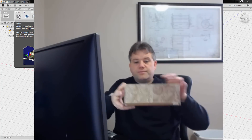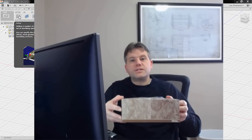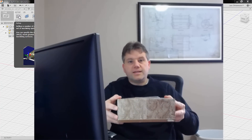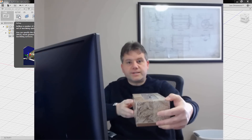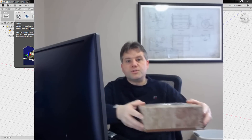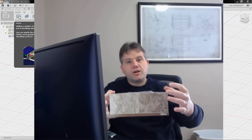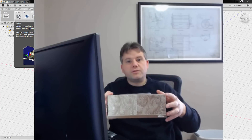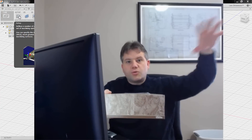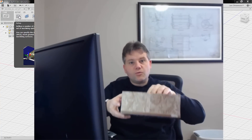There are no rules about what is up and down on a part, so how you approach machining it might be different than the person who designed it. Pretty much what we're doing in the setup dialog is telling the software how things are out at the machine. The best way to describe it: if I have this tissue box as our part, how is it going to sit in the machine when we're standing in front of it with the doors open? Is it sitting like this or like this? And where is our block on the machining table? We've got to determine where we're going to pick up the stock.